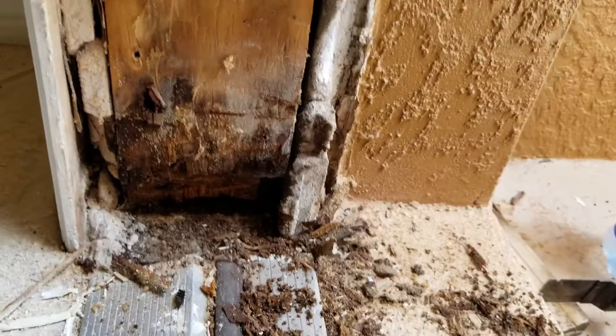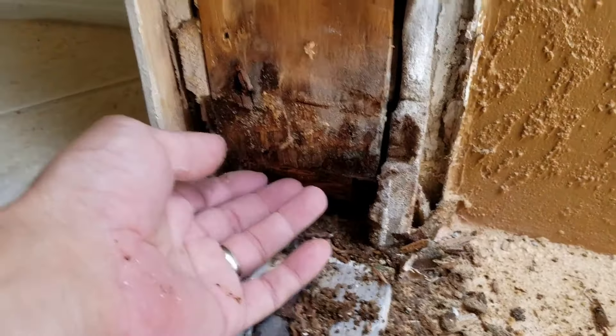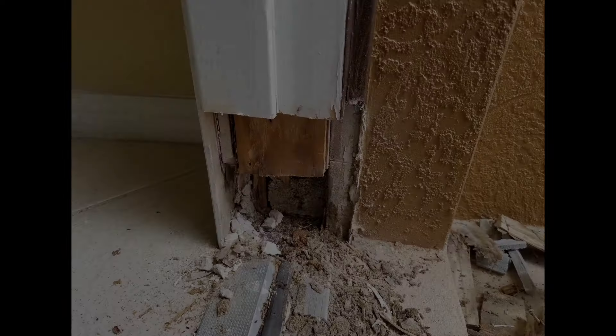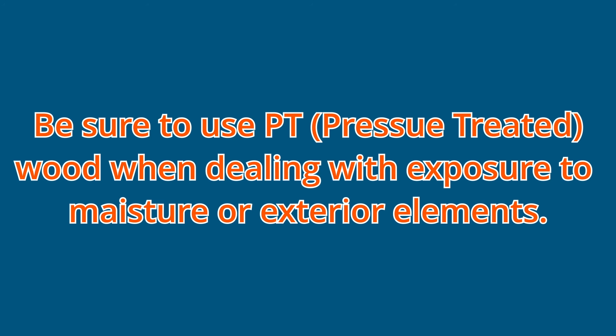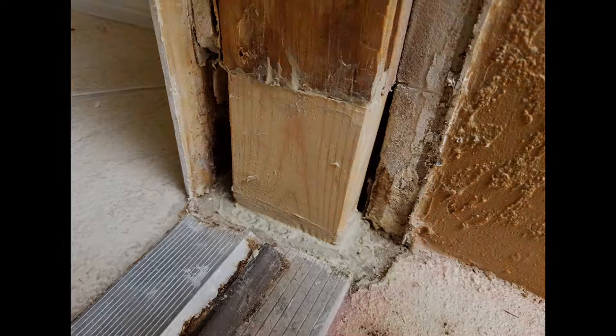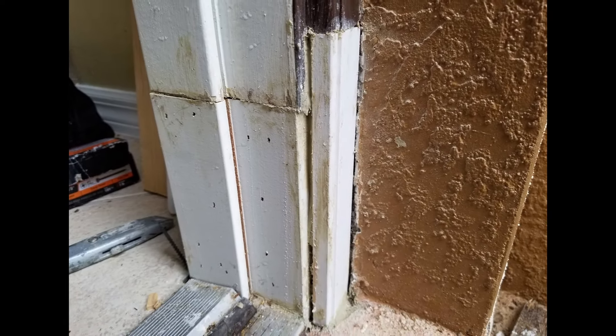In this circumstance I went ahead and cut that section off. My goal was to install some pressure treated 2x4 — make sure you get pressure treated. You install that pressure treated 2x4, go ahead and seal the area pretty good. I used liquid nails in that section and let it dry.